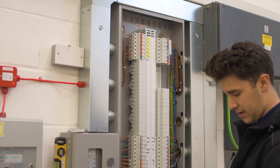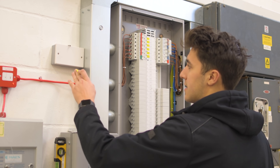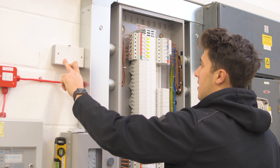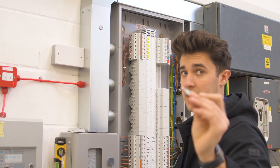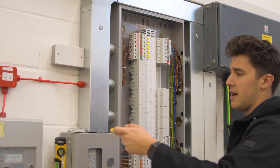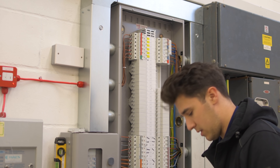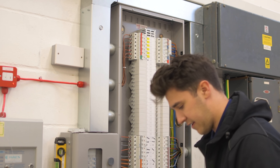I had to reconfigure a lot of the lighting as well because the fishtail key switches didn't work properly and there were lots of places where they were switched in two places. You had 400 volts here unnecessarily, and the fishtail there - the emergency light test key point - and then another one round the other side on the same circuit. So I've tried to strip that out and simplify it a bit so there are fewer breaks in the circuits. That took a bit of sussing out.